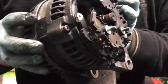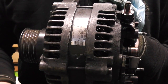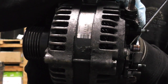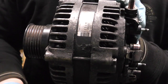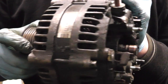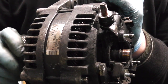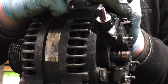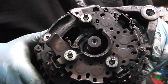On this particular old one, because there was diesel leaking on it, the slip ring is worn — that is the main problem here. But that actually happens very rarely. That's the only alternator of this type I've seen with this problem, and it was because diesel was leaking onto it. Regardless, I'm going to show you how to replace the rectifier, which is nine out of ten times the cause of the problem.